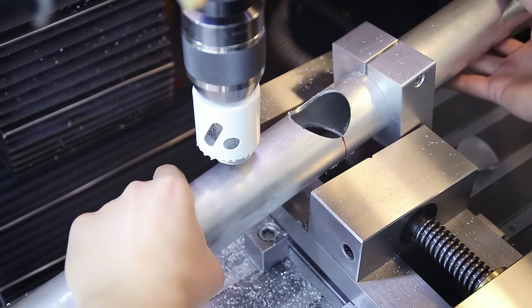I'm setting up some of these angles spaced apart according to the inside width of the cage, and when I place the tubing in there they act as stops making sure everything is parallel and evenly spaced. I also marked a center line exactly between the two parts, which is going to help me line up the cut later and also shows me I need to take off a little bit of material here so that the ends don't collide with each other. Once everything fits I add some cutoffs to hold them down along with some clamps, and now this entire jig can be picked up and brought over to the mill.